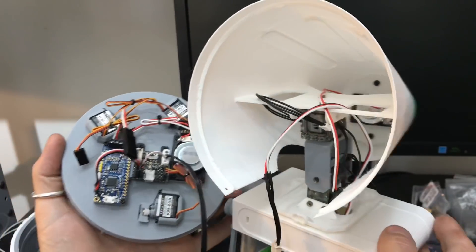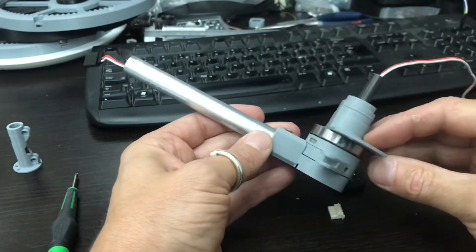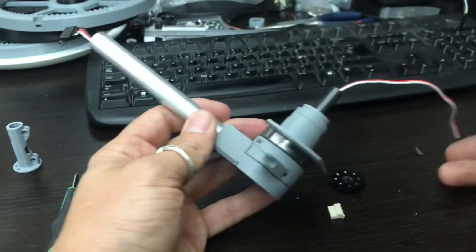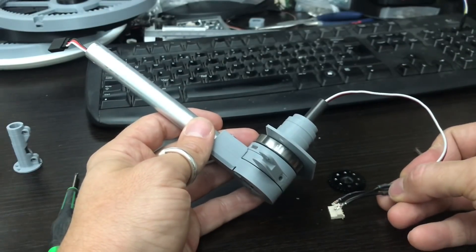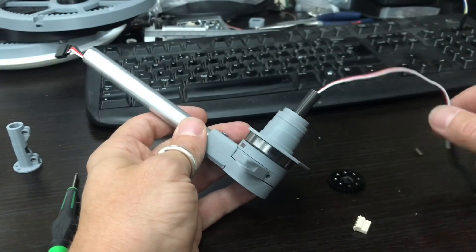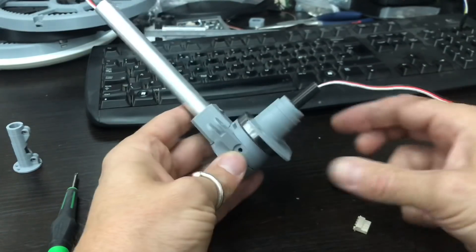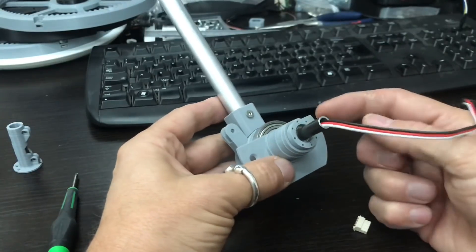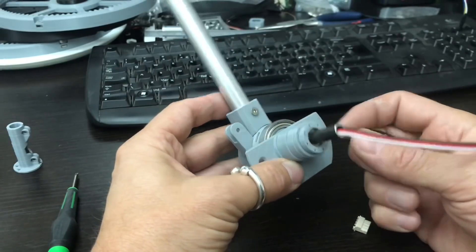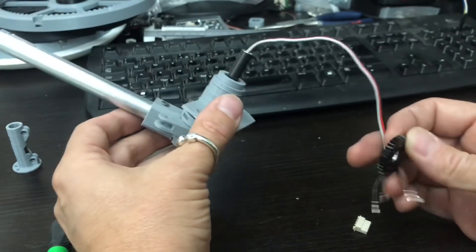Something to note with the neck pitch assembly when feeding wires through: I actually did it while fully assembled from this end down, then soldered on a Molex connector for the LSS servo bus system. The nice thing is you can pop the pins out of the connector, feed the wire back down through everything, and take it fully apart if needed. On this side I'm also looking at increasing the bearings from 25mm to 30mm, which would mean they'd go over this cog so I don't have to take this apart every time to remove the sub-assembly.